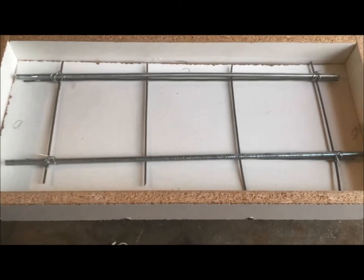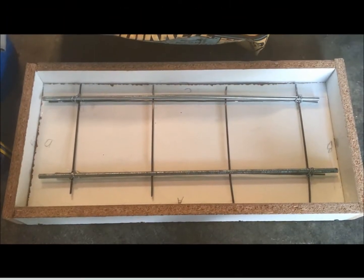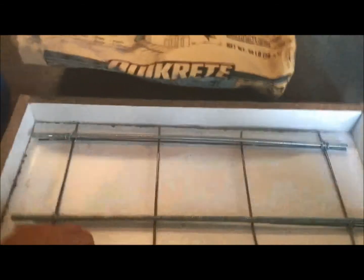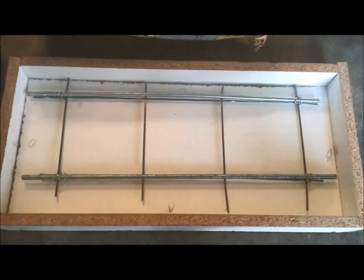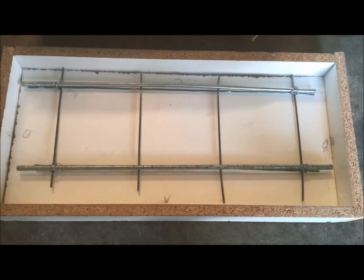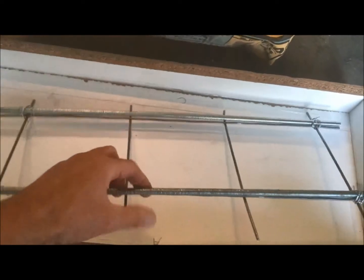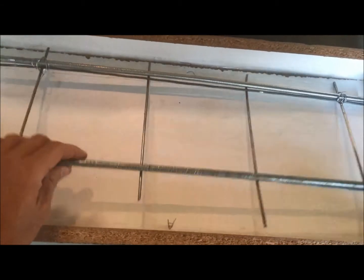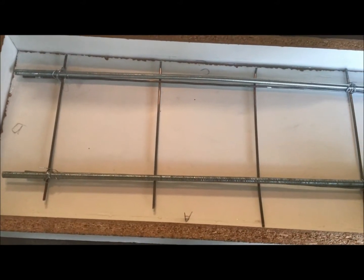You can always return a bag, so no worries there. The material you're going to need is obviously the mold from video one — whether it's this flip-over mold I built or a pour-in-place mold, which is also described in that first video. You'll also need some wire mesh and some rebar. I had some all-thread laying around, which is the same as 3/8-inch rebar, which I recommend. You set that in the middle of your concrete pour to stiffen up the whole slab and make it as strong as possible.